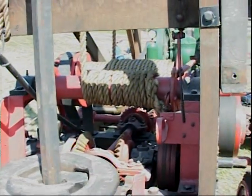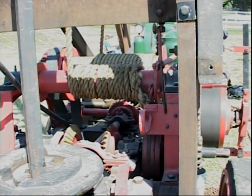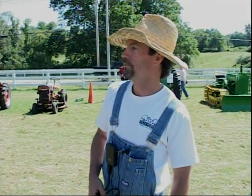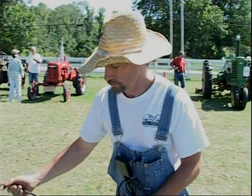It has a Rockford clutch on it that engaged to turn the table, and it was run by a nine-horsepower Fairbanks. They could drill about two to three hundred feet deep with it, sometimes four hundred if they had to. Then the tools got so heavy they couldn't lift them up out.